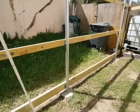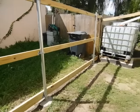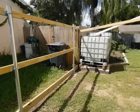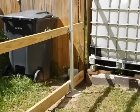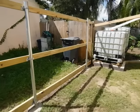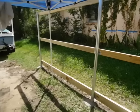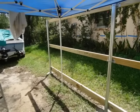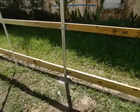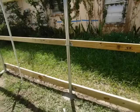The posts are set at 8-foot centers, with the exception of the very back where I've got about a 2-foot space on that side. Other than that, the gap between posts is 8-foot centers. I dug the holes 27 inches deep to allow a couple more inches for gravel at the bottom, and then setting the posts at 24 inches.